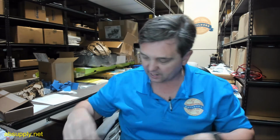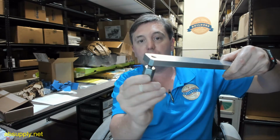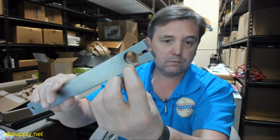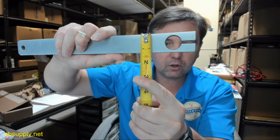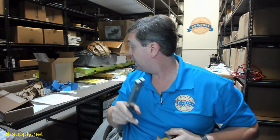Then, with the door in the 90-degree position, you are going to attach what would be the main arm down to the spindle. Of course, that threaded end is going to work into the main arm. Now you're getting the concept how it goes. Splines down here for attaching to the spindle, the shaft spindle. Overall length of the arm about 12 3/8. Overall width about 1 1/4 inches, with a thickness right at about 1/2 inch. And by the way, this weighs about 4.6 pounds, the entire arm package it does.